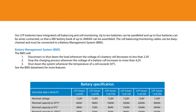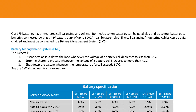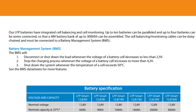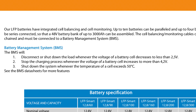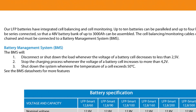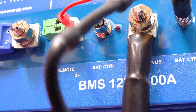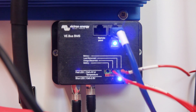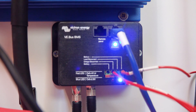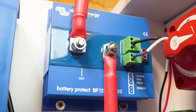The values set within the lithium BMS seemed extreme to me, and you can't change them. The lithium BMS has a fixed over voltage cutoff of 4.2 volts in any one cell, and a fixed under voltage cutoff of 2.5 volts in any one cell. However, I already have the kit to tackle this. In my true belt and braces approach I wanted to change these voltages. All it would take for the charge or load to be cut is the disconnection of their positive feeds. This would cut both the solar MPPT and the alternator in the event of a high voltage, and cut the load if the voltage got too low.